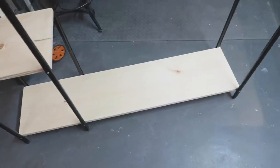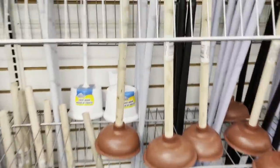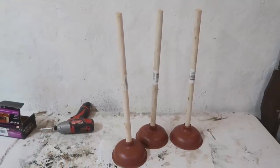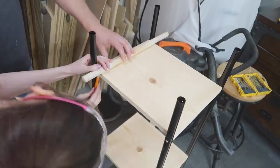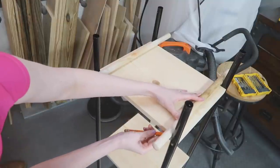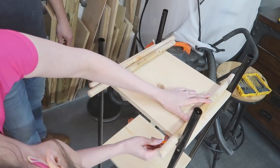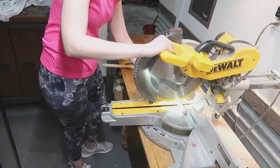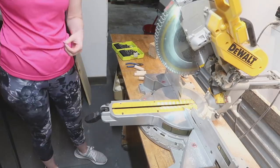It's really starting to look like something — we have that long shelf on the bottom and the two smaller ones on the side. Remember those plungers from Dollar Tree? We're going to grab those back out — all three of them. Get the stickers off using the heat gun, plastic razor blade, and Goo Gone, and take the plungers off the bottom — we're just going to be using the wood part. These are going to go on those very top holes marked at three-quarters of an inch. I laid them on the shelf and marked where I needed to cut them, then took them to my miter saw. You can also use a hand saw and miter box from Amazon for about $12-$15.